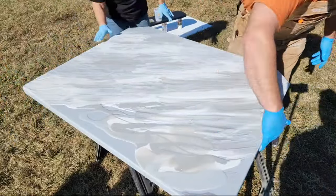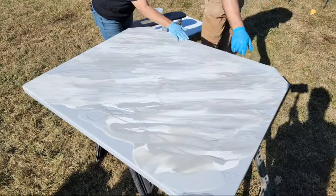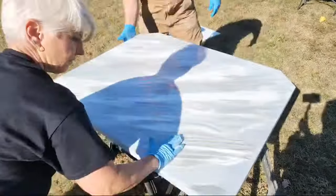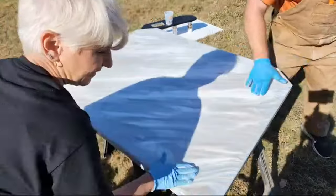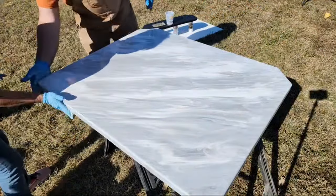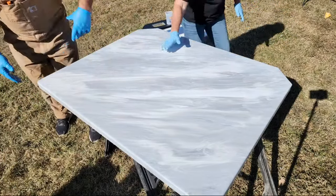Bringing it over those edges so that it can flow. I'll run some resin over and wet that down completely — what that does is when resin flows it's going to be real uniform. There's little single runs going — it's going to continue running unless you break up that surface tension. Rub those edges and now the colors will flow uniformly. We're using three ounces per square foot on this surface and you'll notice we did not tape our edges. A lot of times we will tape our edges when we use more than three ounces per square foot, but this finish doesn't require that.